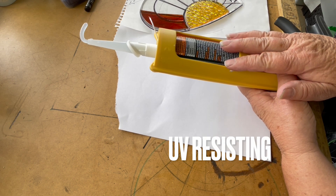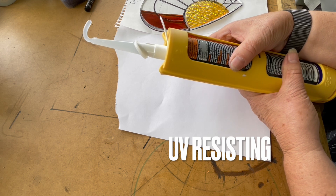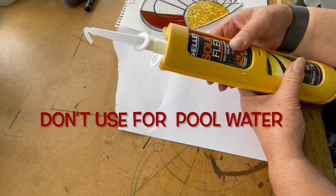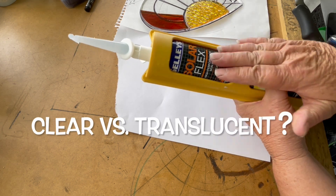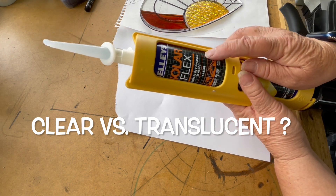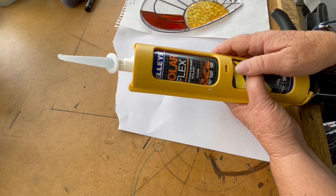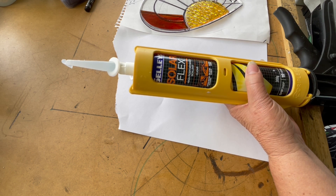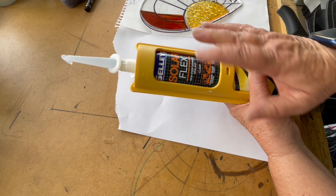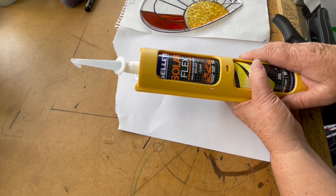For Australia, it's worth noting this glue is great for weather and UV resistant, which is always a consideration here. That's my favorite — this is what works for me; everyone will have something different. On the topic of adhesives, there's also the question of clear versus translucent. You can relate this to the grouting world: with translucent adhesive or grout, you may see a creamy look, especially if your grout lines are wide, giving a creamy gray color rather than something invisible. That's the difference — pretty straightforward.